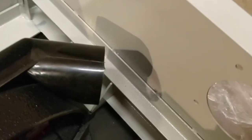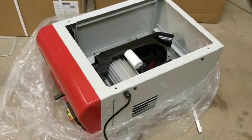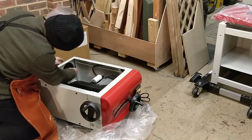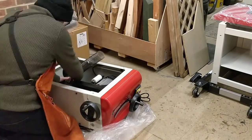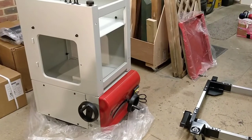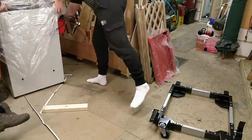First I put the handle on the side that controls the angle of the blade, then the handle on the front that controls the height of the blade. I then fit the 100 millimetre dust extraction port and connect it up to the saw using the provided flex hose. The supplied feet would normally screw into the base, but because I've got the optional cabinet, these holes are used to secure the cabinet in place, sandwiching the bottom of the saw between the saw and the cabinet.